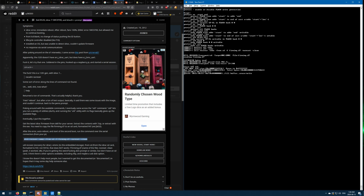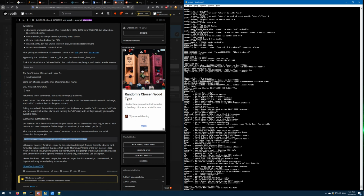Yeah, so clear the SPI, LCL, whatever that is. That sounds like it's going to work. Erase util flash. Failure writing block. So I think that eMMC error of 0 size is the problem. Okay, I'm going to have a look on the forum and see if there's anything else.